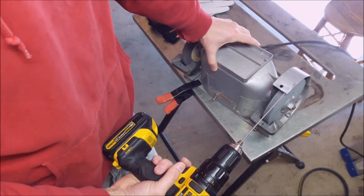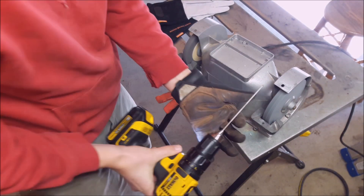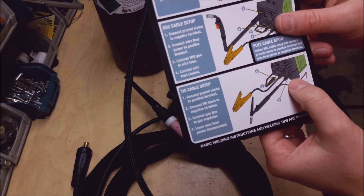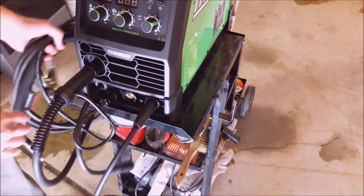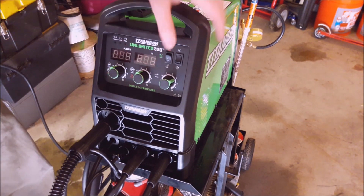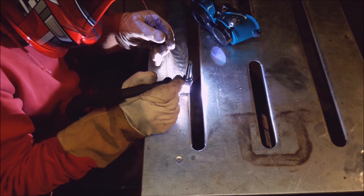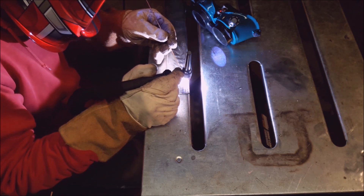There are many ways to sharpen tungsten. One of the quickest and easiest ways I saw was to just chuck it up and, with a wheel grinder, grind it to a point — simple as that. For the setup: TIG torch goes to negative, ground to positive. The filler rod I'm using is 1/16th inch ER70S, which is a very common filler rod for steel. I did pick up a 3/32nd as well, but that seemed too big — the 1/16th inch works great.